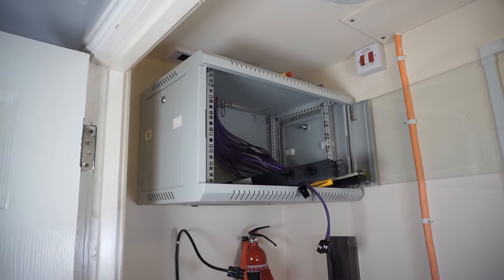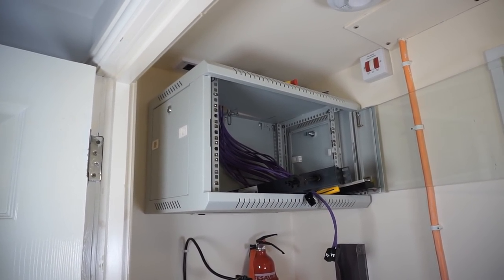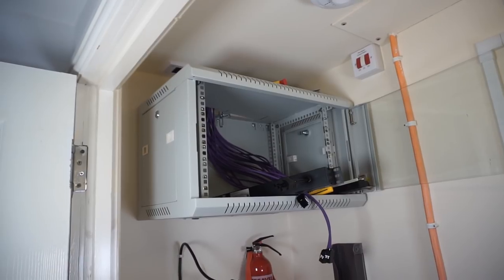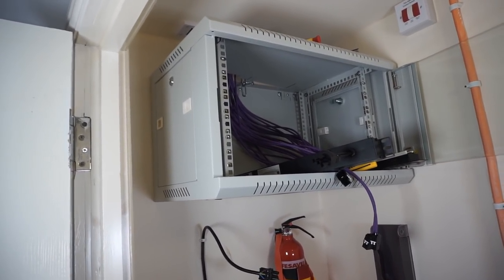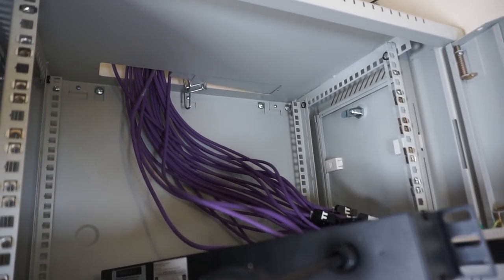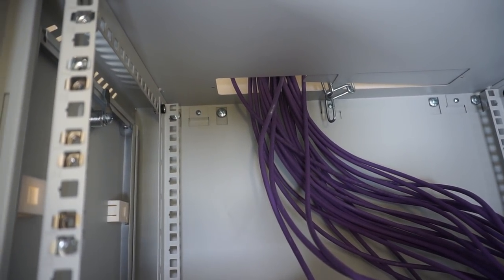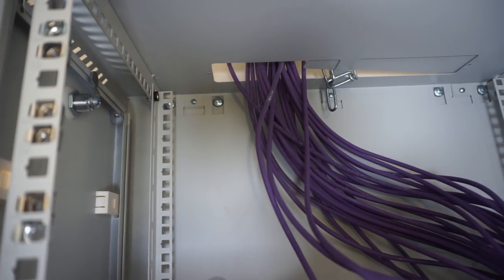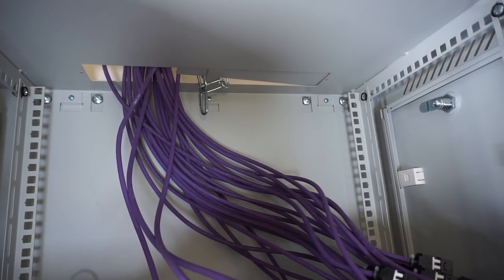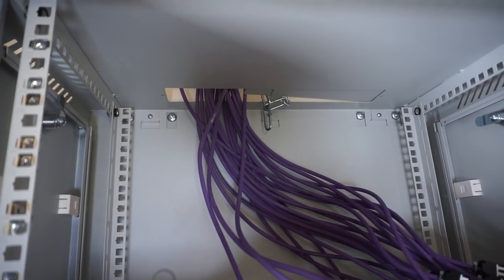So yeah, now that's all done, the next step is to get this cabinet off the wall. It's almost a momentous occasion because it's been up there for so long and it was such a significant project, but yep, time to take the cabinet out. I won't be able to do it on video just because there's no way I could fit in the space, because I'll need to clear all the cameras and lights out the way to get out of the cupboard. But you can see at the top there, there's two big screws on the back. They hold the bracket to the wall. And there's a smaller screw in the middle. There's one there, one in the middle, and one at the side. So basically, if I take those smaller screws out, that unlocks it from the bracket, and then it just lifts off the bracket and comes out. So it's a pretty easy system to get in and out.